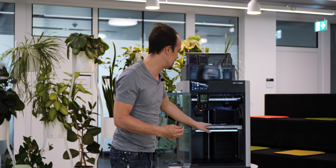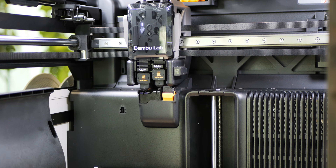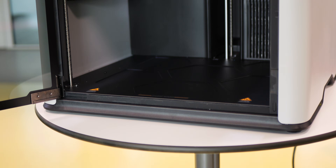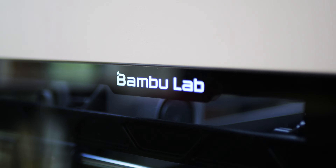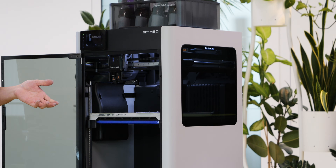The engineering on this is top-notch quality and for a price where other brands don't even offer their starter printers, let alone industrial ones. What I really like about this printer is its build quality. As you can see, it uses linear bearings instead of the carbon rods that the X1 Carbon did. They also got rid of the recessed base, so 3D printing — especially when filament switching can get messy — is now easy to clean out. Everything feels high quality: what should be metal is metal, and what can be plastic is injected plastic, not 3D printed plastic. I can't stress that enough — I hate when 3D printer manufacturers 3D print their own printers, because 3D printing doesn't have the tolerances needed for a machine that must move super accurately.